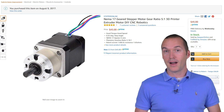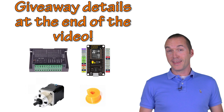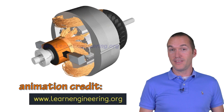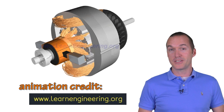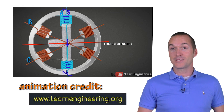Next we need a motor to move these things. I opted for a planetary geared stepper motor with a 5 to 1 gear ratio. Stepper Online makes super high quality stepper motors for relatively cheap. I purchased them on Amazon.com for around $45 each. Let's talk briefly about the important differences between a stepper motor and a normal DC motor. When you apply current to a DC motor, it spins in one direction. Raise the voltage and it spins faster. Flip the polarity and it spins in the opposite direction. But one thing you can't do with a normal DC motor is move to a specific location and lock it in that position. That's where a stepper motor shines.